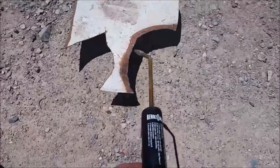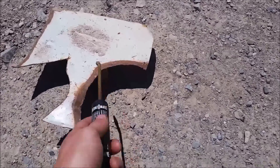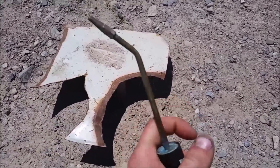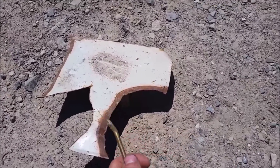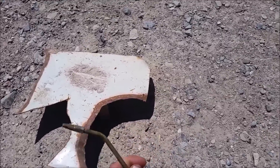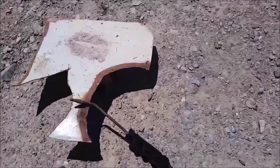I've still got gas, so I'm going to try something. This torch head right here normally wouldn't be able to cut steel — it's just for welding. But hydrogen will burn with extra oxygen. With an oxy-acetylene torch with a welding tip on it, it would just blow the torch out when you turn up the oxygen, so you really can't cut through steel. But hydrogen might actually stay lit. So I'm going to try to cut through this piece of steel, especially since I've got extra oxygen. I think this might actually work. I think that's burning.